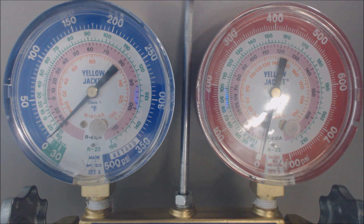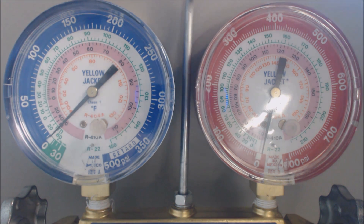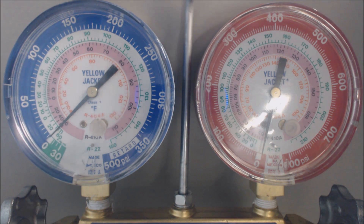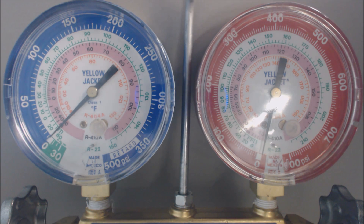You normally turn a system on, let it run five to ten minutes, then start checking the refrigerant charge. During that time, if you notice a vapor pressure of 40 psig on R22, that will be low — you're looking at somewhere around 16 degrees in the middle of the evaporator coil. If you wait five to ten minutes, that evaporator coil is going to freeze and have frost on the outside, and it's not going to be able to absorb heat from the conditioned air in the house.